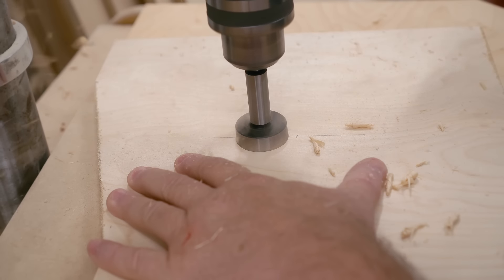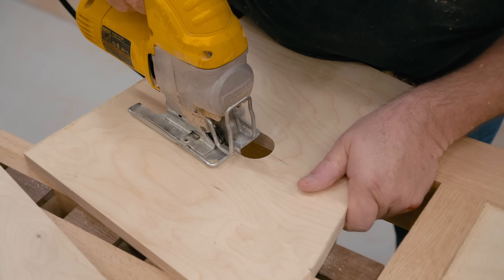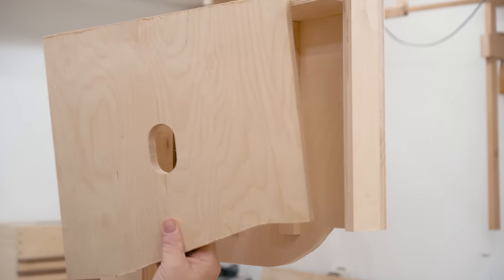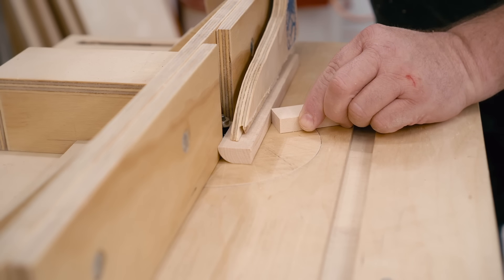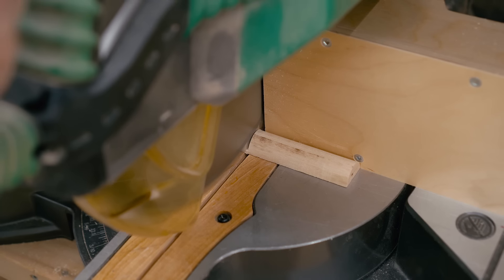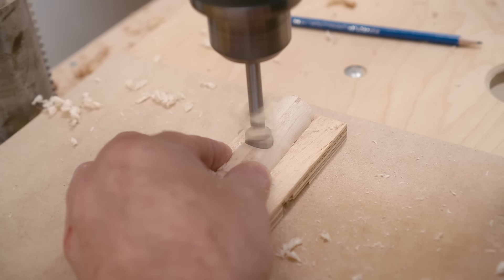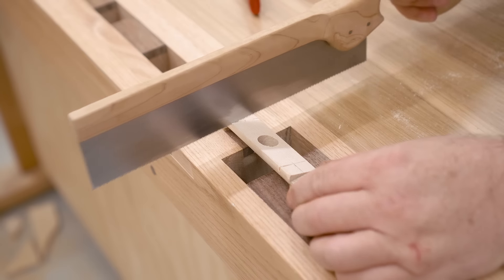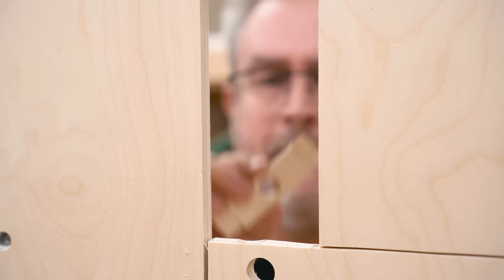This has an oversized elongated hole for the upper wheel axle to go through, and that elongation gives the axle room to move up and down to tension the saw. The part that I'm making now from solid maple is the upper wheel pivot — it's basically a one-inch dowel split down the middle, except I'm doing it on my router table with a half-inch router bit. You can see that this is sized to fit between those guide bars on the upper part of the frame. I also need to mark and cut it on the back side to make relief cuts to allow it to tilt up and down.